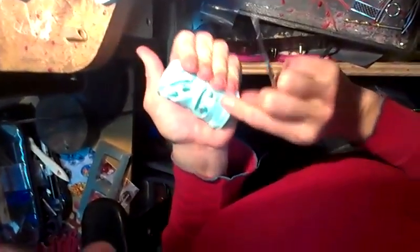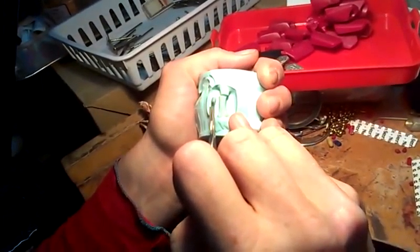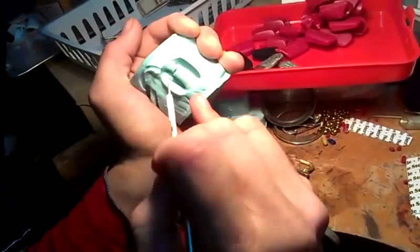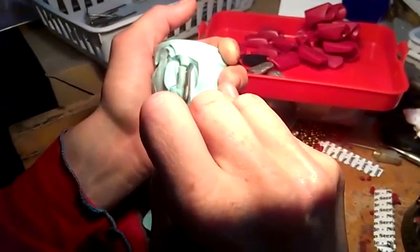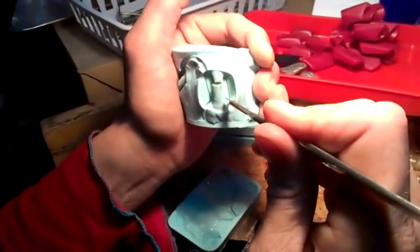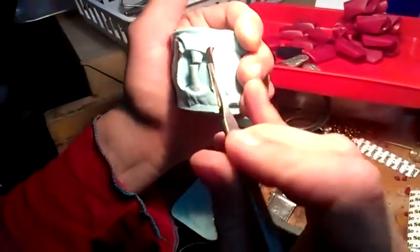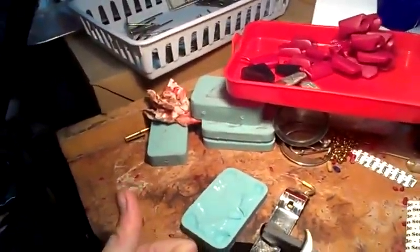And then the other thing is venting. So super gentle and right into the tiniest corner, as accurate as you can. You do a cut line at the high point. In the case of text, sometimes you have to do an unbelievable amount of cuts right across the face of the object, or detail, in a way that you really would desire not to if you didn't know it was going to disappear later. What's the venting for?